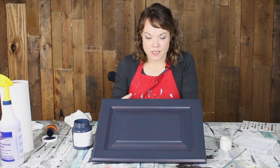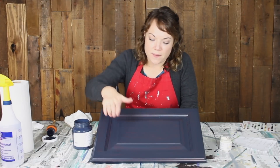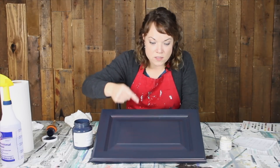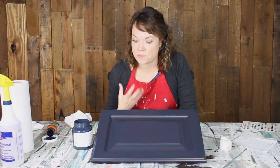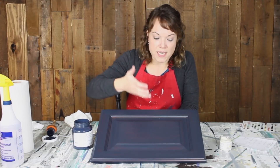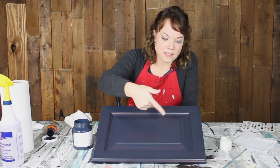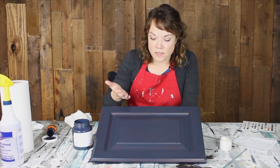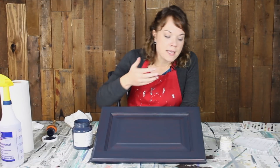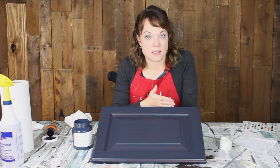The wax is dry. I know it's really hard to see, but this side has the wax finish on it and this one does not. It increased the sheen just a little bit. I did buff it and it could probably be buffed again in a few minutes — it just adds a little extra smoothness and a tiny bit of shine. So if you're a fan of clear wax, this would definitely be something you'd like. Overall, the paint is not quite a one-coat coverage paint — you can see wood showing through — so it would definitely need a second coat, which also increases durability. It's a smooth-to-the-touch paint with a great sheen and a finish I really like. There are some brush strokes showing, but I think it will level out nicely with the second coat.